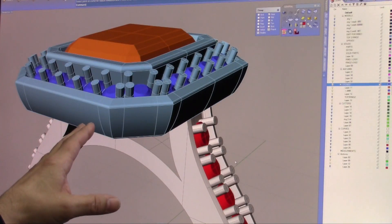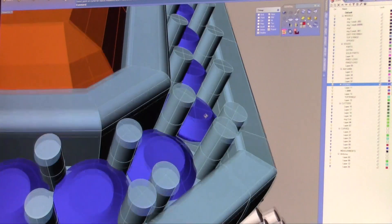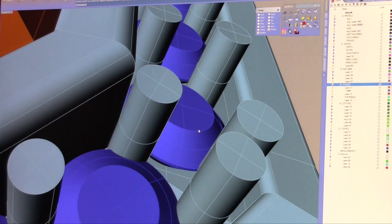When they come out of the solid-scape machines, they have to be handled. They have to go through de-waxing. That in and of itself is going to break these prongs off — they're not going to make it. So when you have something that looks good this long, it doesn't mean that it's good for the process that you're putting it through.